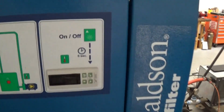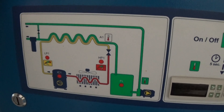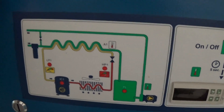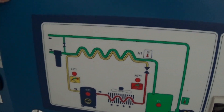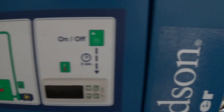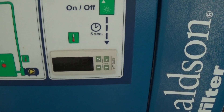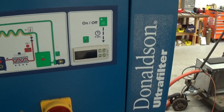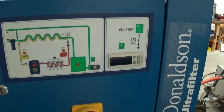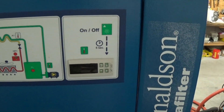The only other thing to keep in mind is just notice here, in addition to this nice schematic of how the chiller flow, heat exchanger, condenser, pressure switches, and so forth work — which is another nice thing about Donaldson. That little symbol there is what represents the bypass I just mentioned on the inside. Notice, in addition to the power disconnect here, to turn on and off you basically hold this first button here for five seconds. We got the fluid heated up to about 49 or 50 degrees. When I turn it on in the next video after I get the covers on, you'll probably see an HT symbol, which just says it's hot compared to the relative set point. In fact, we're going to show you how to change the set point too.